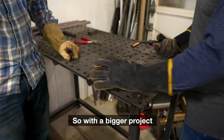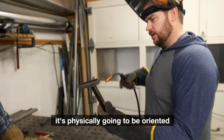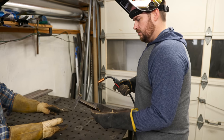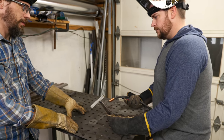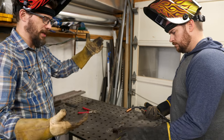With a bigger project, there are a lot of things to consider — like how it's physically going to be oriented, because you've got to get up into stuff. Which is part of why you want to have a welding surface that is grounded. That way, as long as any part of this is touching the table, it's grounded — you don't have to worry about placement as much. You can stand something up and weld here or whatever.